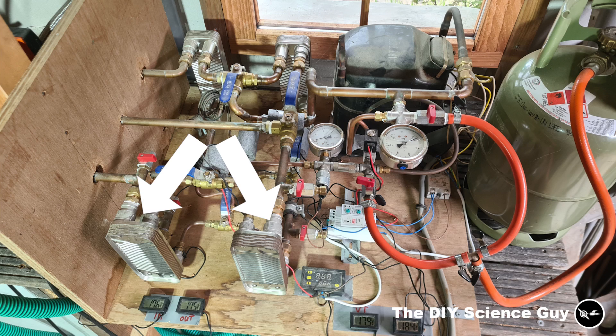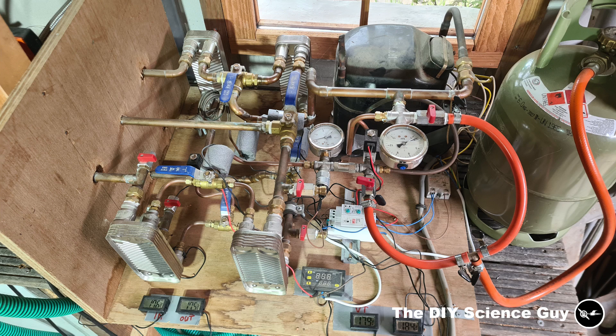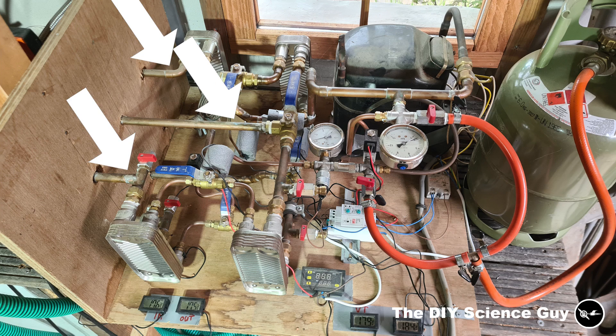The plan is to replace these heat exchangers for ones that can handle a higher pressure, so I don't need this whole pressure switch system anymore and can operate at a bit higher pressure, so the condenser temperature also becomes higher — I want it to be around 40 degrees Celsius so I can hook it up to the central heating of my house. I also want to replace this compressor with a variable output compressor so the heat pump can work at its required performance without shutting off and on all the time. These compressors are quite expensive, so maybe I will build my own. I also need to increase these pipe diameters to decrease resistance.